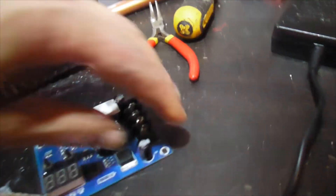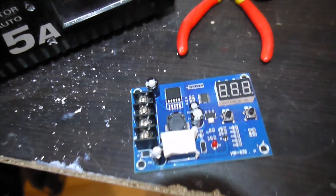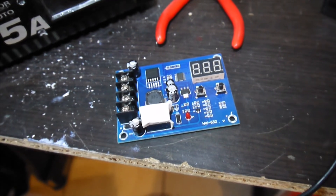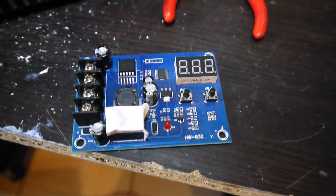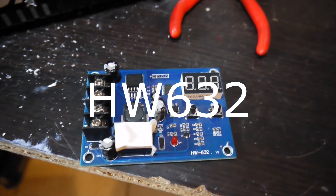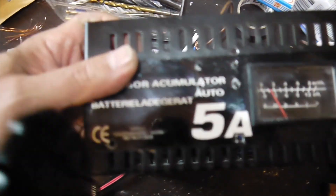The first step is done — the rectifiers are in place and the ammeter is working as it should. Now I'm going to add one of these modules that connects and disconnects the battery at a certain voltage. That will act as overcharge protection. It mounts in the front panel, so now I have to cut all these holes for the display and the controls — it's going to be a lot of work but fun at the same time.